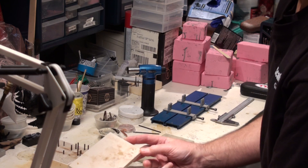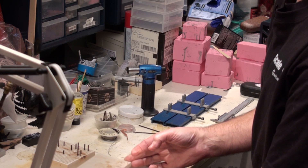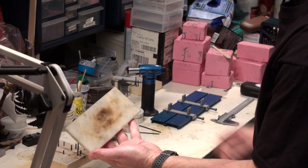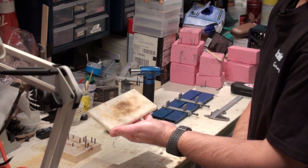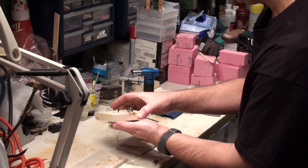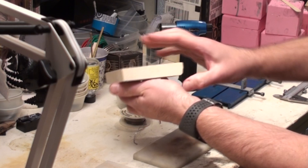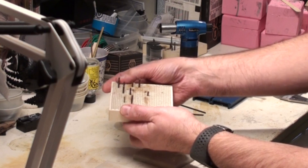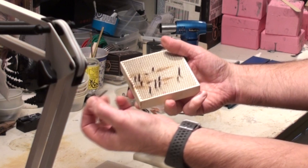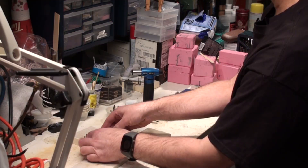Sometimes I use just a piece of ceramic — this is actually porcelain ceramic tile. It's relatively flat, takes a lot of heat, really good for soldering. I also use a piece of marble, and the great thing about marble is that it takes a lot of heat and is very, very flat — great for putting pieces on for soldering. To align things, you might want to use a jig of some sort, so I created one. This is a ceramic filter you can get online, and you use 3/32nd piano wire that fits in the holes perfectly. That's how you can line up axles and pieces of brass, and then you've got a jig that you just put the pieces in and solder away.